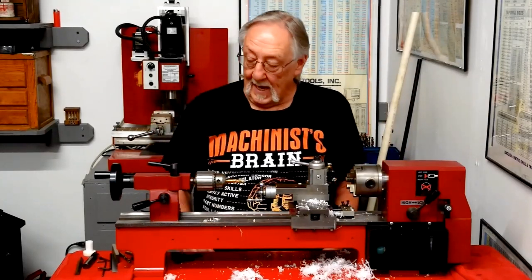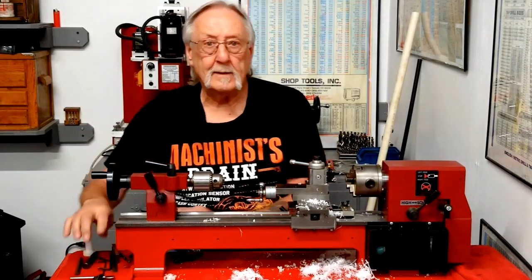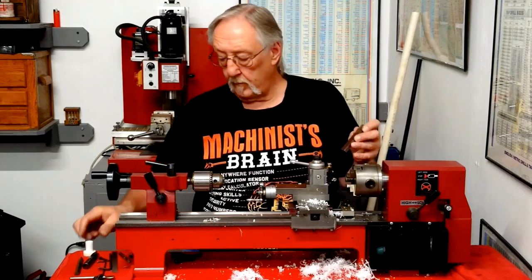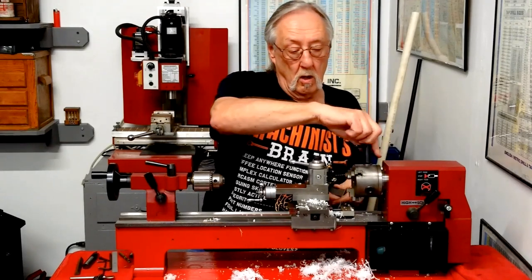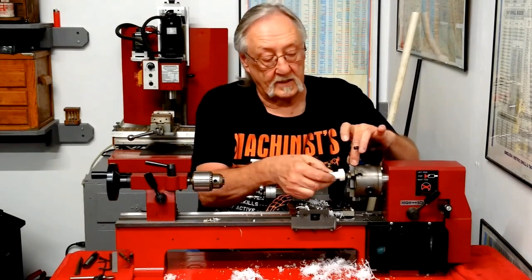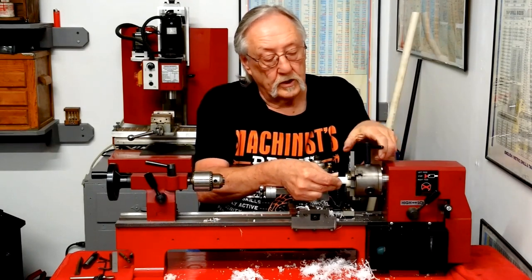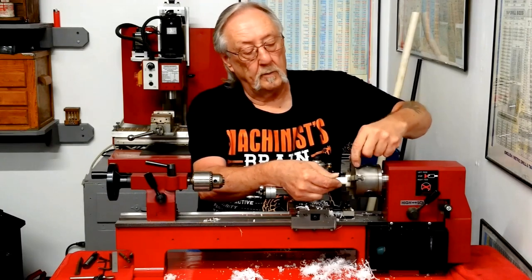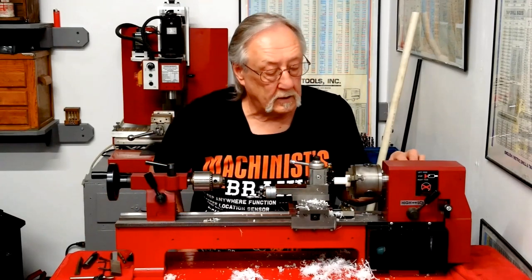Okay, I'm back and I think I know what I'm doing. Let's see. All right. I've got a piece of ground steel. And I'm going to place that behind my part as such. Take this. I had just faced this. Push that against my ground piece of steel, tighten that up, pull this out. Let's turn it on and see how good it turns.